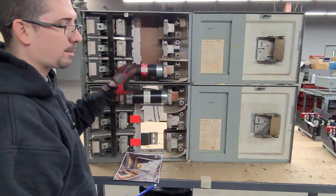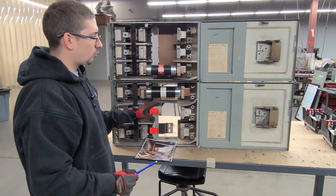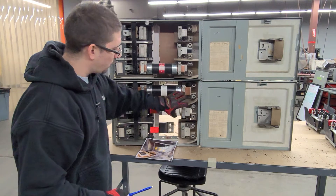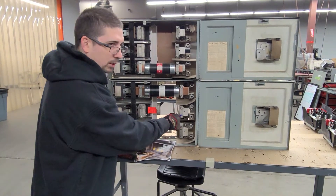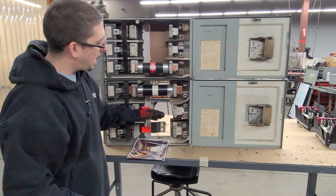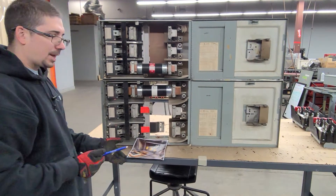Assuming it's a 400 amp clip style setup, we'll give them a 600 amp switch, we'll modify the nameplate to be a vertical setup, we'll move the fuse rack up, we'll give them the standard copper pieces for a bolt connection, and then we'll give them some custom ones to compensate for any adjustments that we've made. I think that should be good.